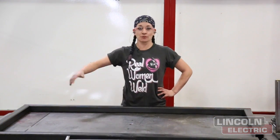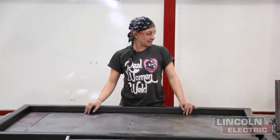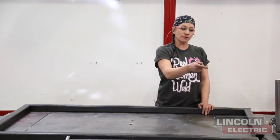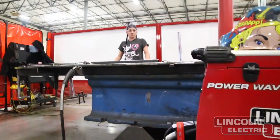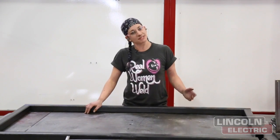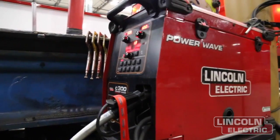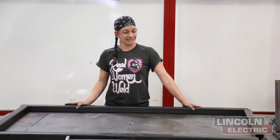My name is Samantha Cardinuto. I'm a welder here at Lincoln Electric Cutting Systems, been here for about four years. Today we're going to be welding up some fabrication tables using 2x2 tubing with 3/16ths wall. I'm welding with a PowerWave C300, which is an excellent machine — great for production welding, home welding, whatever you need. It can weld very thin metal, very thick metal, do air arcing, and stick welding. I'm going to be welding with setting 13, wire speed 345, and a trim at about 1.0.